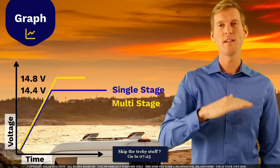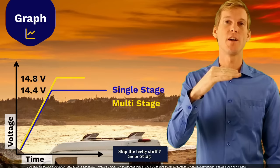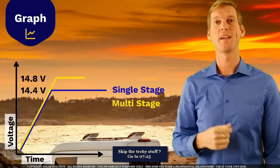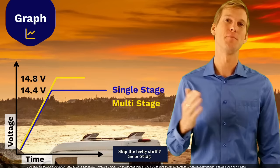The reason you want to stay at the higher voltage is that deeply discharged batteries can only be 100% recharged if you go to a higher voltage level, whereby all the discharged particles are placed back into the charged state — the sulfur from the lead plates is completely brought back into the electrolyte. Now this voltage level is good for charging the battery properly, but the battery doesn't like it that much; it's not the best for overall lifetime if you would continue at this voltage.